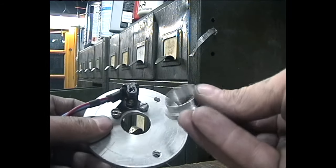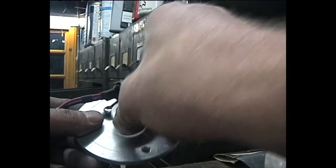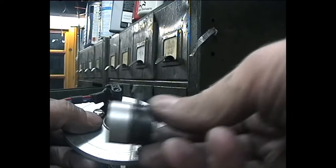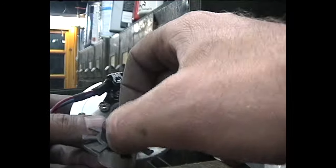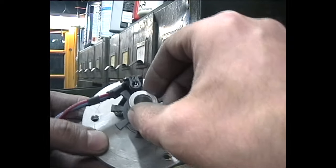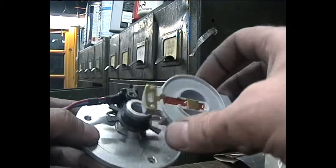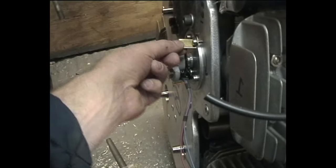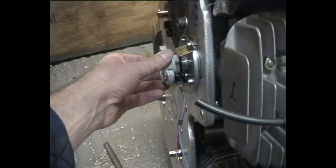This is just a little spacing plate that I've made up. It pushes on that way around — I shall find it has to go this way around because the timing plate knocks it. This is the holder for the interrupter and it goes on there. This is just so when I mount this all on the crank I can centre it perfectly. This spins round that way and this rotor arm goes on there. The distributor is essentially finished. These are the brass plates to hold the distributor cap on, screwed in there. I've got to glue it on yet, but it's stiff enough to stay where it is.